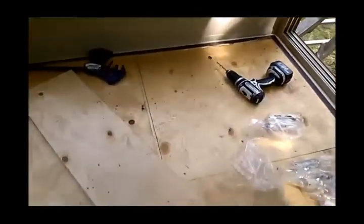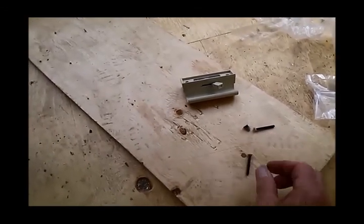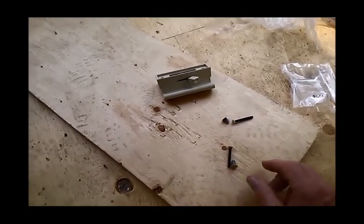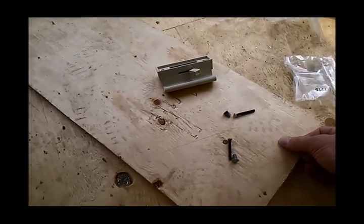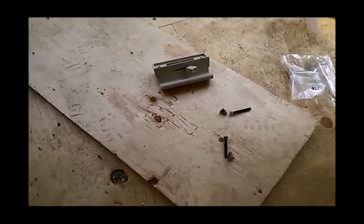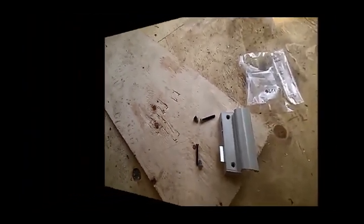So that's using these, these are called Chicago screws. The nice thing about using a Chicago screw is that it's attractive because it's blind on this side, so it's got a nice painted finish. And you can always snug them up if they get loose, which is much better than a sheet metal tapping screw, which when it gets loose, there's nothing you can do about it. So that's what's holding the handles together on your sashes, is color matched Chicago screws.